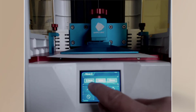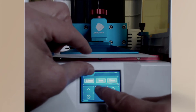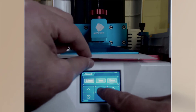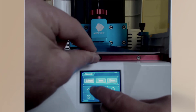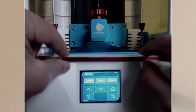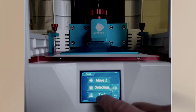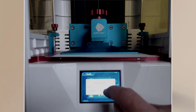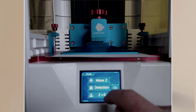I want to be able to pull the paper but not push it back in. I'm going to keep going down, taking it slowly. Now I'll go to 0.1mm and pull this in until I get resistance on the paper — a bit more, a bit more. Now I can pull it out but I can't push it back in. My plate is exactly level. I'm going to hit Z equals zero, then hit Enter — that means it's confirmed. It comes back with 'setting OK'.